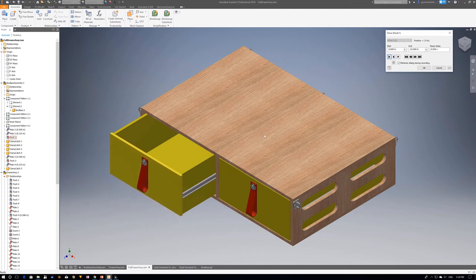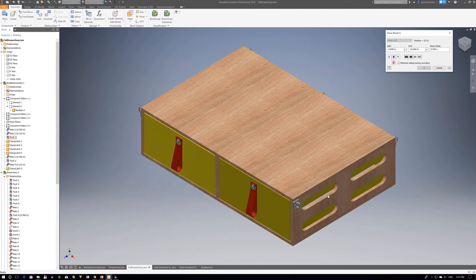A word about the holes in the sides and back — that was an idea I had about weight saving. Initially when I set the materials, the system was telling me this was about 80 pounds, which is not insignificant. That was using three-quarter plywood on the outside. I switched to five-eighths and cut out those holes, and it took 10 pounds off the model, bringing it down to 70 pounds. That's a 12–15% savings in weight, which is pretty good.